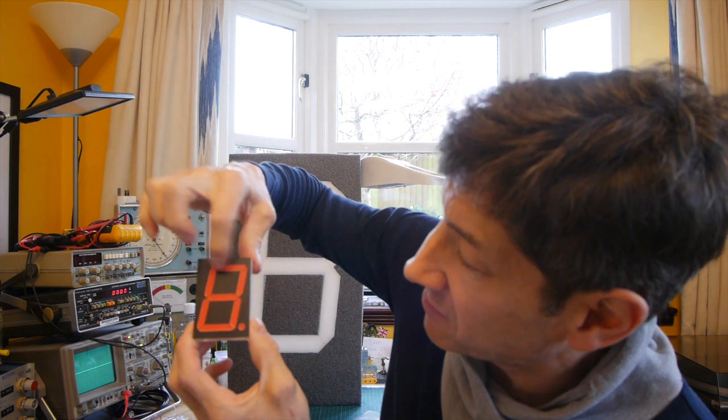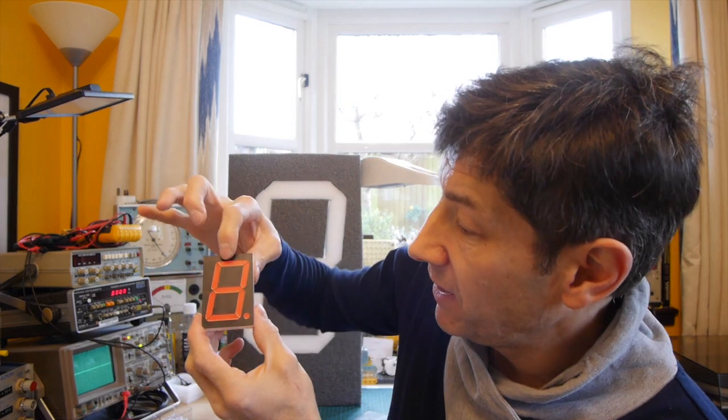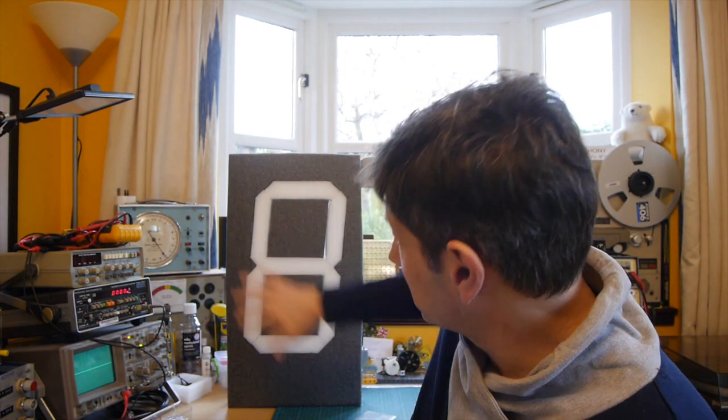The other thing you need to know is what order you're going to light them up in to get the letters or numbers you want - they always go in a sequence. The top segment is called A, then B, C, D, E, F, and the middle bar is G. So if you want to make the number one, you need B and C lit up, and there are contacts on the back that do that for you. You can't just plug into one wire and get the number you want - you need to know which segments to light up. So what I had to do was build something that would be the mechanical structure of my massive seven segment display, and also create some electronics that would clock through a series of numbers and feed them to the right LEDs to make the number we wanted on the screen.